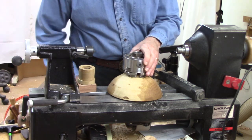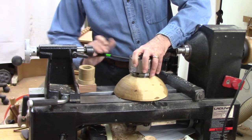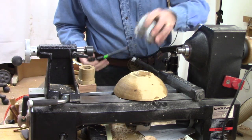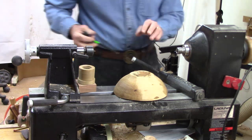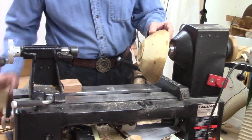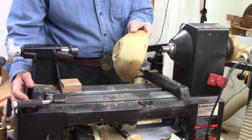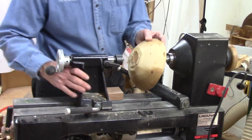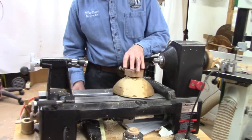And now you've got that hole, you can center this on your lathe using that hole we've just marked to true up the bowl like this by bringing up the tailstock, with a chuck with a spindle blank or something holding it up like that, now that we've got it marked. Now this trick also works with your faceplate or possibly a glue block.